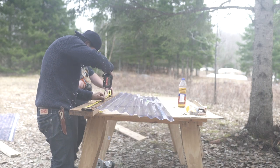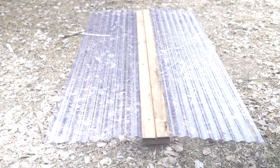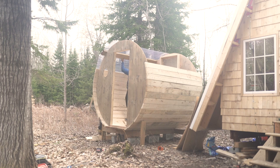We then switched over to the roofing. The roof consisted of a two-by-eight pressure-treated ridge beam, and we attached two two-foot corrugated PVC sheets to either side. These would act as a rain barrier but also a see-through roof. We sandwiched it onto the two-by-eight with a one-by-four up top.